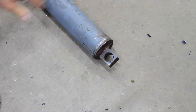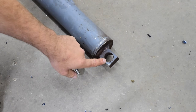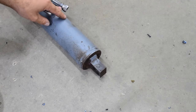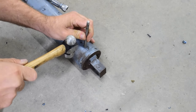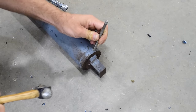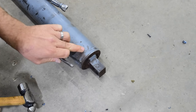One more critical thing before we throw it in the lathe: the port for the line is on one side and the eye is on the other — it's offset. So we need to make sure this thing is timed right when put back together. I'm going to put some center punch marks on the cap and on the barrel just to give me an alignment reference when I reassemble it.